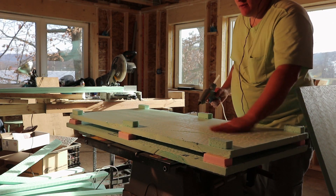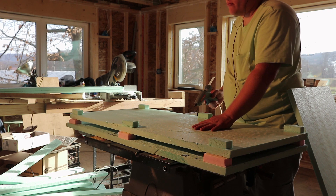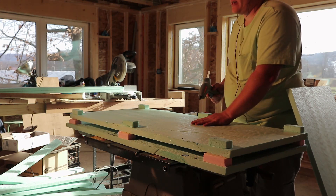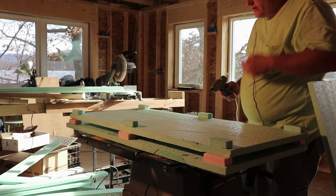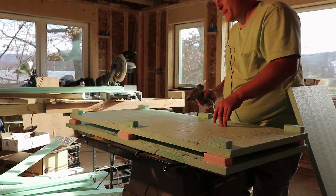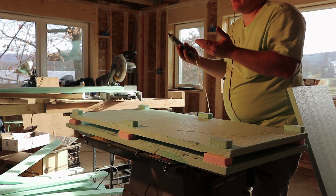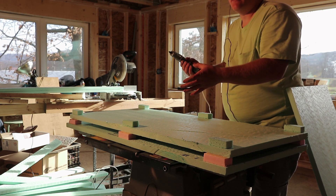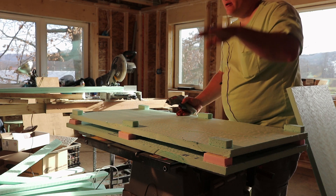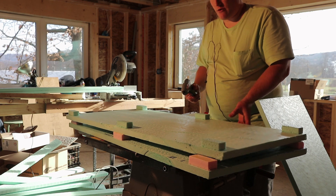These are the baffles that I'm putting up, and they have these blocks on them which allow an airstream to flow up between the roof sheathing and the foam, so the cellulose insulation I'll blow in isn't going to clog up the rafters for the soffits. The reason this is important is that if you don't have enough insulation on the roof against the roof, you get ice dams — heat rises up through the insulation, melts the snow, and once it gets off the edge to the overhang it freezes. But if you have airflow, it allows your roof to stay cold through natural convection through the soffits.